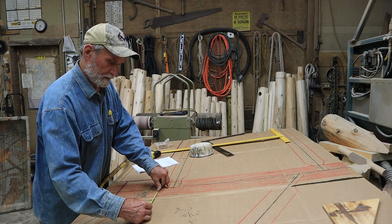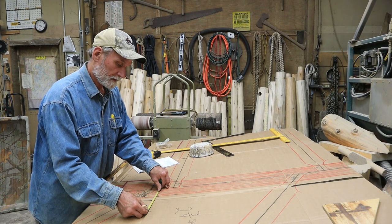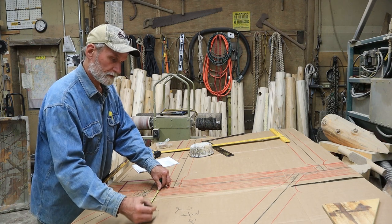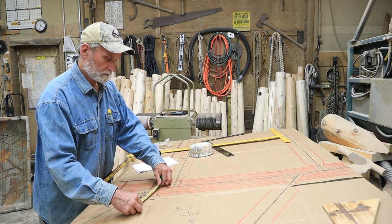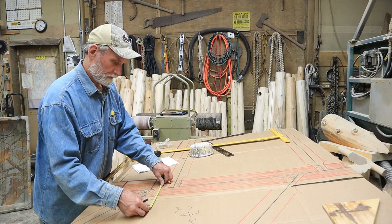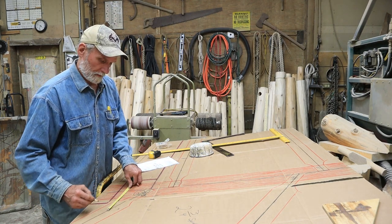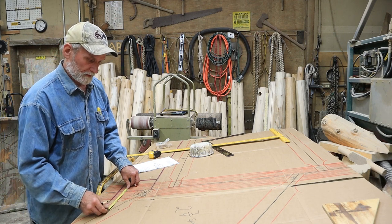And then 1 3/8 over. And that gives us from center to center, like here, 4 + 2 3/4, so it's 6 3/4. Center to center would be an ideal number, but then at the angle, what is it? So we can go, here is the middle, 6 3/4 over. All right, the middle, and then from the middle of the post, that's 9 inches. So we come down here, 9 inches over, and that would be the middle of our first spindle.